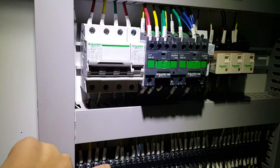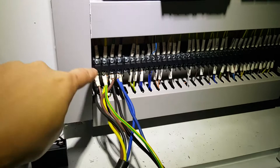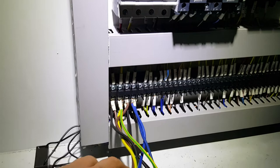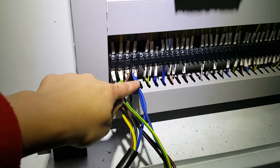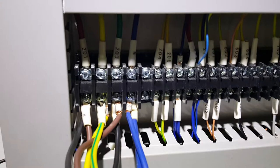This is E, right? 1, 2, 3, fire wires. This one, 2 blue ones. 1, 2, 3, fire wires. This blue one, neutral wire. The empty one is a fire wire because we use the 4 wires here, so we don't have the ground wire. In your factory, you may have the ground wire. Connect the ground wires here. So we finished all the wires.